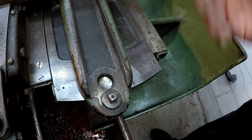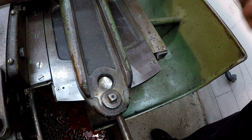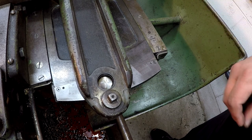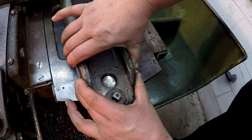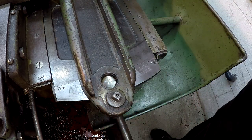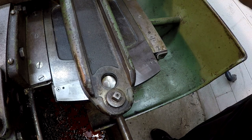Now, if you're doing something like a piece of pipe or a flange, where you're boring something for a pipe thread, that's 3/4 inch per foot. I would line this up on 3/4 per foot as best you can with that magnifying glass, lock the thing down and go for it. All right, but if you're doing something really precision, you need to make sure that the part is indicated and running nice and true with that angle.